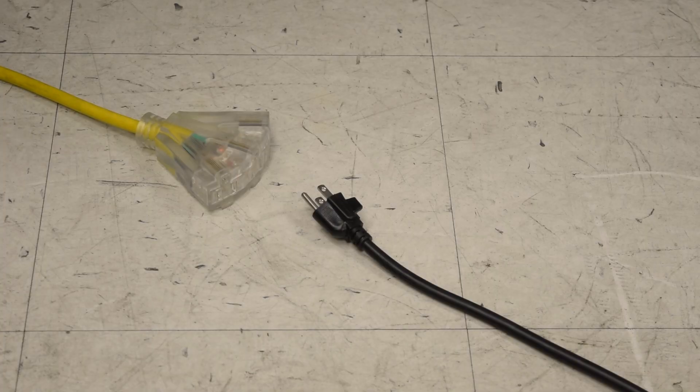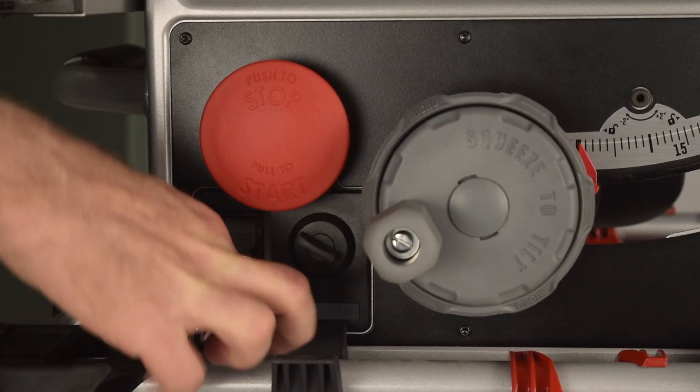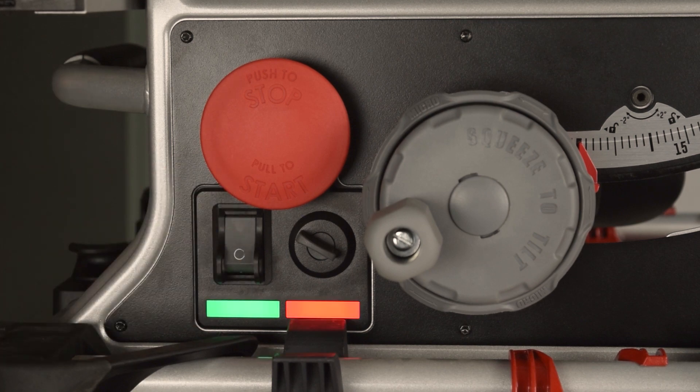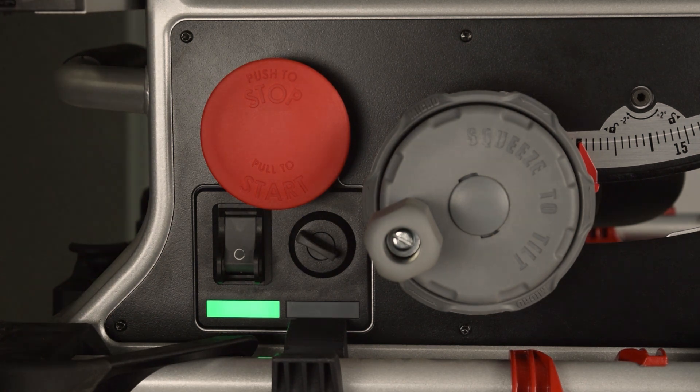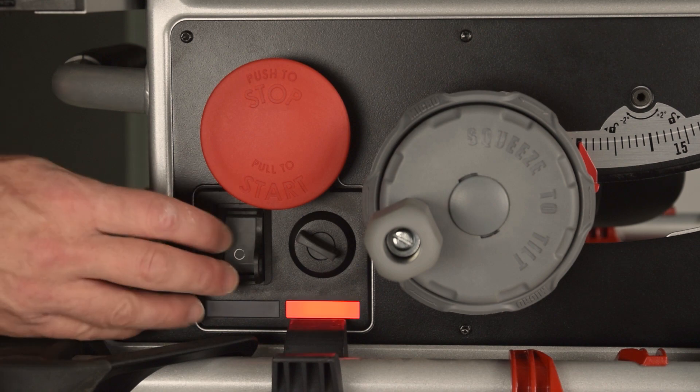Finally, you'll confirm that the status of the system is normal. Plug in the saw, unlock the power switch, and turn on the power switch. The red status light should blink slowly for a moment to indicate the system is initializing. The red light should then turn off and the green status light should display as solid. In other words, the status lights should indicate the normal start-up process. If some other combination of lights display, switch off the saw.